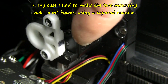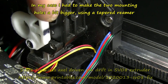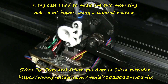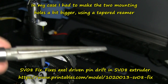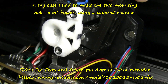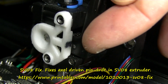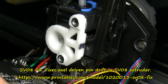The edge of this does go against the edge of this path. What I have to do is make these two holes slightly bigger. I use the tapered reamer, just gently from each side in those two holes. The pin does come this way and not that way — so that is ideal.